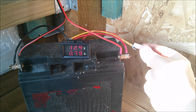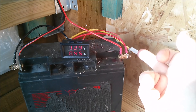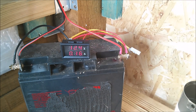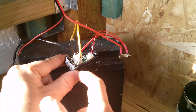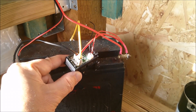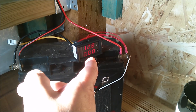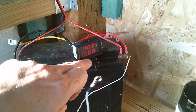The yellow wire, because it's sort of stressed similar to the red wire, came around and touched the red wire. Now we know that the yellow wire is the other side of the current shunt. There's supposed to be a very tiny voltage between yellow and black, and this thing amplifies that voltage and measures it and then displays it. I put a very big voltage — 12 volts — directly across the current shunt, and that might have killed the input amplifier.